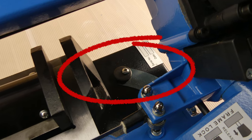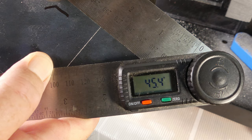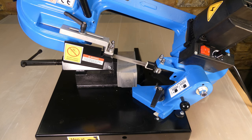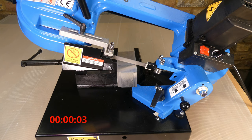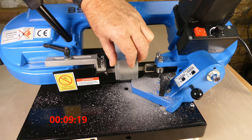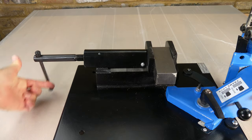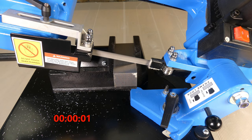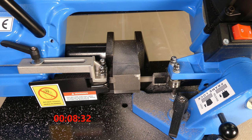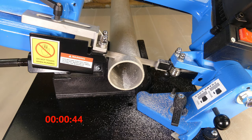It was a bit off so I nudged the 45 degrees stop cam and tried again — so not quite dead on but I'll leave that for another day. Next I tried cutting some 2 inch or 50mm square aluminium, then some 1.5 inch or 40mm square steel bar, and finally some 2.5 inch or 64mm diameter aluminium tubing. This time I increased the speed.